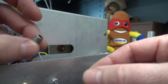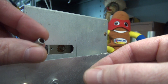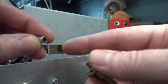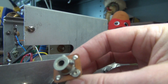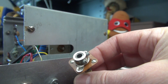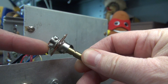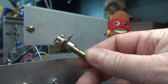So what I did is I found a little spacer. This spacer has an outside diameter of 1/4-inch. The inside diameter used to be approximately 1/8-inch. We put this on a lathe and drilled the center out to 3/16ths. So now it'll go inside of that 1/4-inch hole and reduce it to 3/16ths. Then you simply slide it back on the shaft, take your set screws, put pressure on it. It doesn't take a lot of torque to turn that cap, and you're back in business.